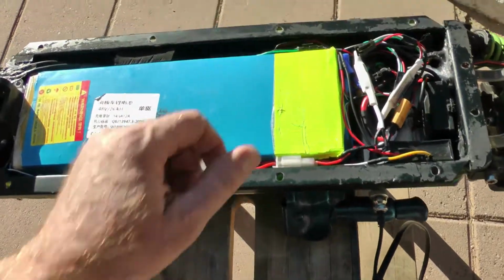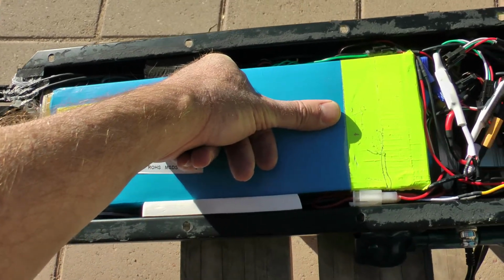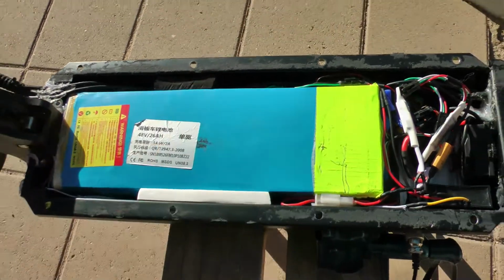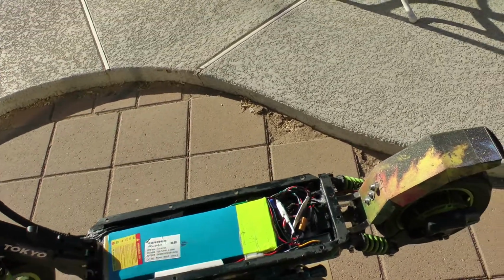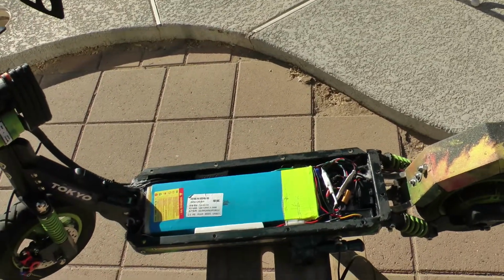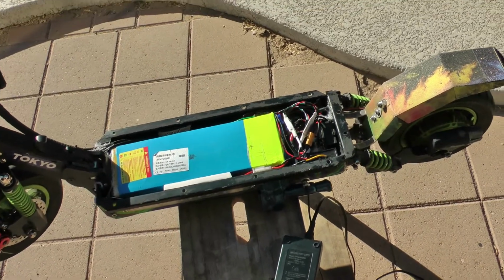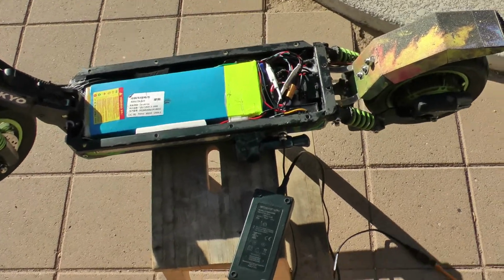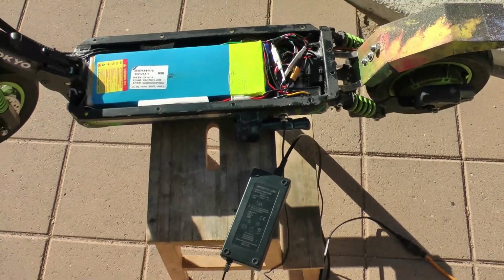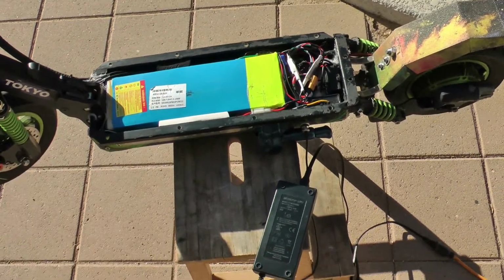Beyond that, I'm going to be constantly testing the temperature of the battery to make sure it doesn't get hot. If the battery doesn't get hot, then it's okay. It can handle the current that you're giving to it. So those are the 2 rules of thumb. One, the battery shouldn't get hot when you're charging it. And 2, you should be able to go from fully drained to fully charged, and don't do it any quicker than 5 hours. The 4 amp charger is going to do that in about 6.5 hours, so we should fall into both rules nicely.